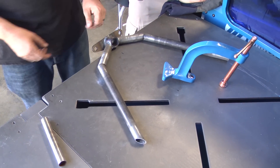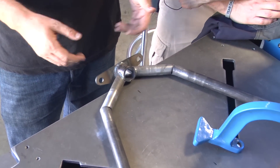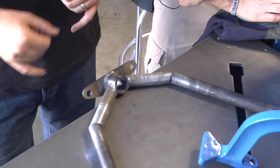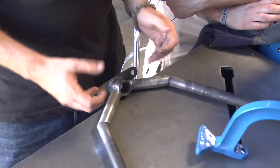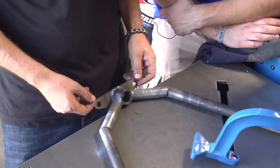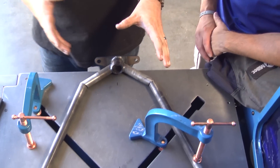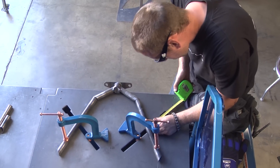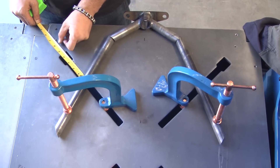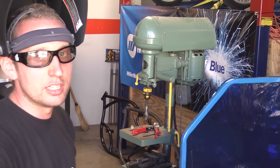So this is what we're starting out with. All of our handlebars start with a laser cut piece — it actually acts as our triple trees for our bikes, slides onto the fork. We have a machined tube up top that slides over the steer tube. What I've done is created a Y-Pattern here that will be the base of the handlebar. I went ahead and welded the Y-Pattern to the top tube and the bottom plate. We clamped the left side of the handlebar down, and what we want to do is mirror the right side. So we're going to take our measurements off the left side as it's clamped, go ahead and clamp the right side, and tack it together. I have my handlebars clamped and we're going to go ahead and tack weld the right side.